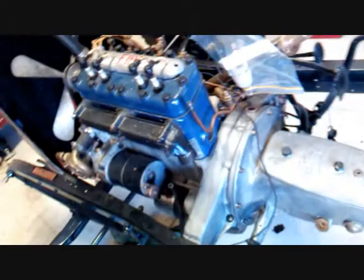It is actually really good in that it will start — third pull, and by pull I mean about half a turn from six to twelve on the crank. It's really good. It'll start after sitting for a couple of weeks too. When we start it, we've got to put our thumb over the oil pressure port because we don't have the tank connected to the oil gauge yet. So in the meantime we just do that and try not to let the oil come out, though as you can see, we haven't succeeded a few times.